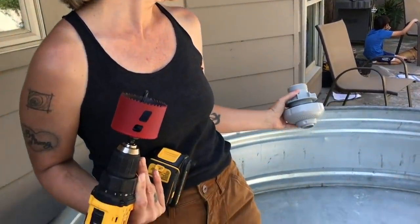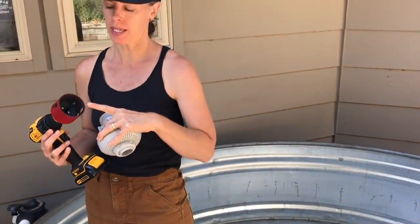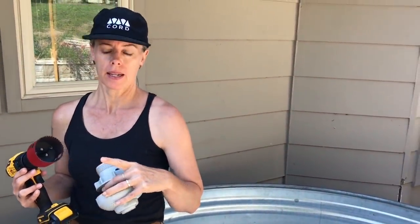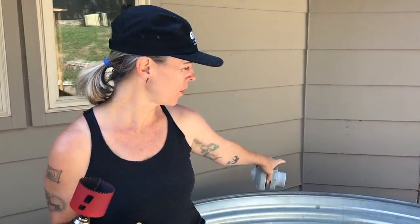We need to take into account the ribs on the side of the tank and measuring enough space to keep the bit away from the rib, so it's a nice flush seal. We're gonna put the inlets and outlets about 1/4 of the way apart on the tank so that there's some nice circulation in the pool.